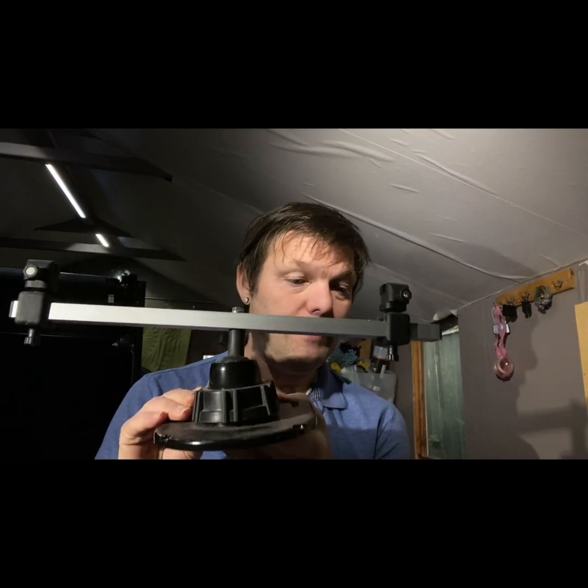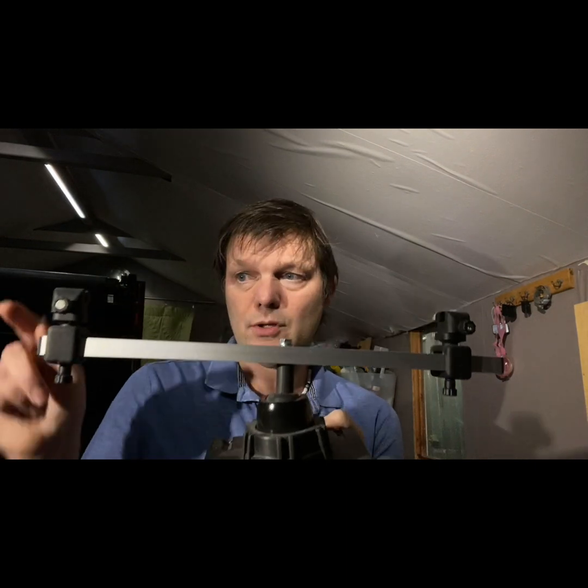And then it goes on to making your jig, which you will need to hold the boat together as you're building it. The jigs are basically something to support the keel as you're fitting in the frames and the boat in general. So this one, as I mentioned in the first episode, is one of the jigs that you can use. You put the keel in, and it just keeps everything in one place as you are working.